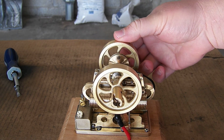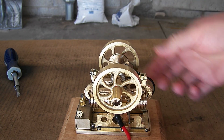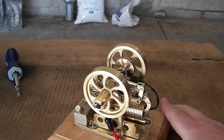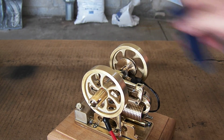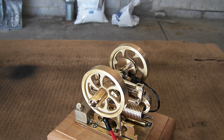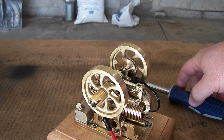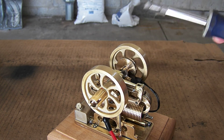I guess something to know about these little engines, the EM1 here specifically. And I've turned this, and there. I'm hoping that that's visible. The magnet for the trigger is right here, and the set screw for the ignition is top there, and the sensor is right here, and the crank is set at just ahead of top dead center.